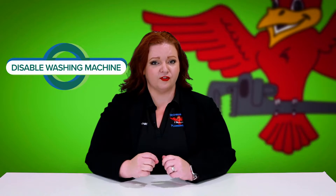The other thing to shut off that maybe you didn't think of is your washing machine. Fun fact: manufacturers recommend that you shut off the valves to your washing machine every time you use it — and who does that? No one. But washing machine hoses are one of the leading causes of floods in Phoenix. Those rubber hoses are under constant pressure, both hot and cold, and over time — bam — you have a flood.